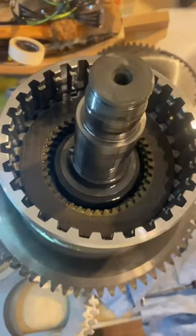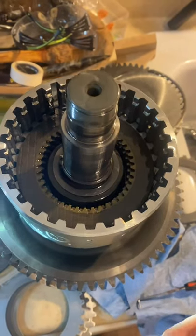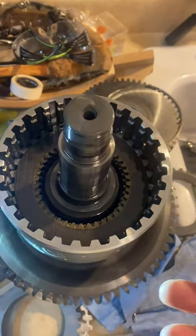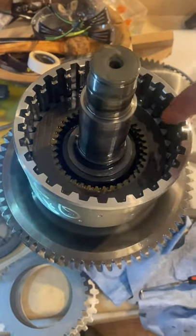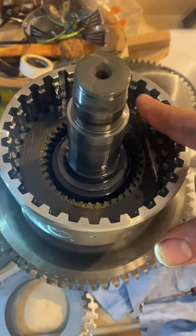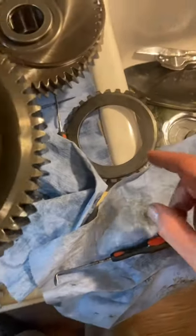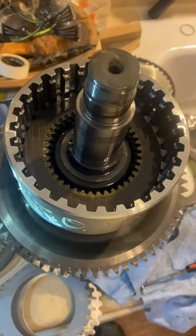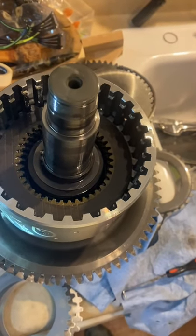This is the last clutch — the first big clutch. I just took it apart and that's the one that was failed. Burned up completely. The rest of them were pretty well fine. Didn't have much slack in this ring right here — that holds that top plate down, which would be this piece. And the first gear has to work with the other gears to get the high and low to work correctly as well.